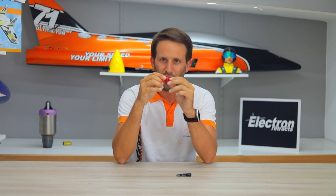Thanks to this extremely well fitting match, we've been able to do away with the need for a second screw to clamp the arm onto the servo spline. Why add an additional split right at the back of the servo arm to assure a tight fit on the servo spline? Why not just mill it with great precision in the first place? And this is exactly what Electron are now doing.